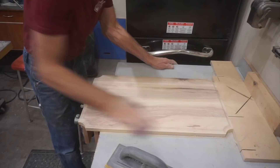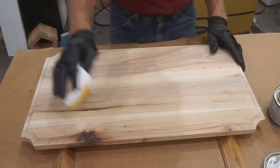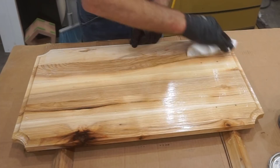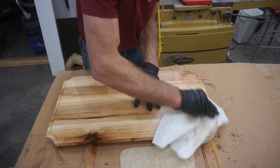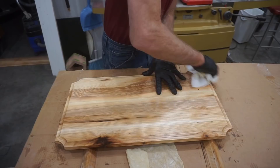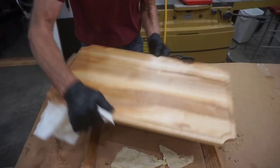The only thing that gets me through the arduous sanding process is anticipation of applying gel varnish to a piece like this. I'm using Old Masters Gel Poly Varnish in the clear satin sheen, and the first wipe makes all the prep worthwhile - you just gotta love the way dull sanded wood comes alive with this finish. I slather on as much as the wood will absorb, wiping and re-wiping until the surface has a uniform appearance. As the finish starts to thicken, I switch to a clean paper towel and buff all the excess off, leaving a very smooth feel to the piece. A bit of compressed air blows thick wet varnish out of nooks, crannies and holes, where a final wipe with the dry towel leaves a uniform sheen all over, so I can leave the piece to dry for a good 12 to 24 hours.